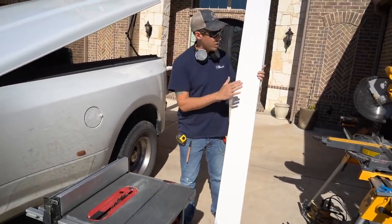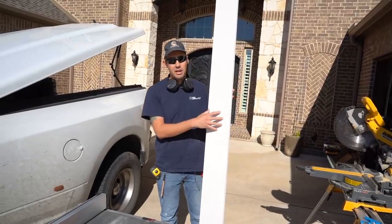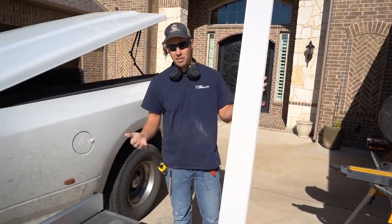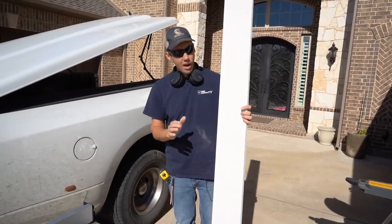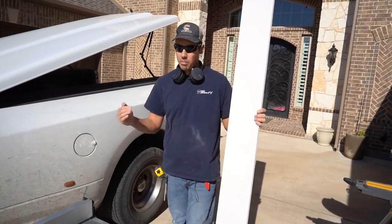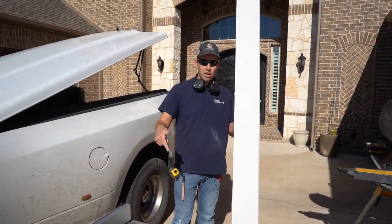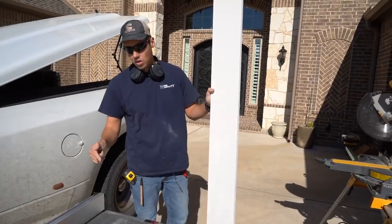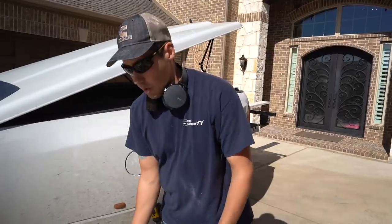The tip I'm going to be showing you is how you can take a piece of solid stock — this is a one-by-eight piece of MDF — and turn it into basically a panel layout without cutting it into multiple pieces. This will all make sense in a minute. This one-by-eight is truly seven and a quarter inches wide, which is a little too wide for what I need for my casing legs for this project. So I'm going to rip it down on the table saw. We'll be using the table saw for the majority of this project, also using the jigsaw to finish the cuts the table saw can't make. I need to set this saw to six and three quarters and then we'll rip this board down.